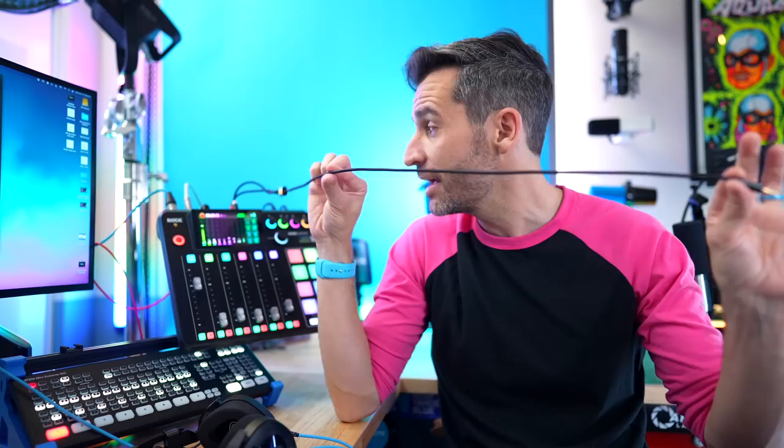Now that we're back on the internal audio from the RODECaster Pro 2, you may have noticed a potential problem with this setup. This cable — the one cable I've ever found that actually works — is three feet or one meter long, which is not very long. That might not be a problem if your RODECaster is really close to your ATEM and you can reach pretty easily. But reaching a camera — I can't even reach the camera that's just an arm's length away from me right now. And I know what you might be thinking: just use a 3.5mm extension cable and run the audio wherever you want. That's what I thought when I didn't know any better, but many years and many tears later, I have found that to be very unreliable.